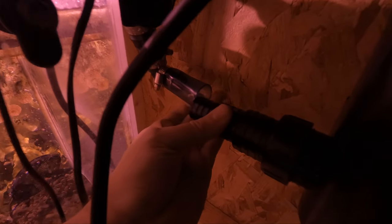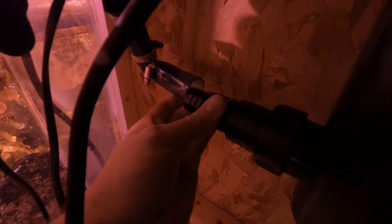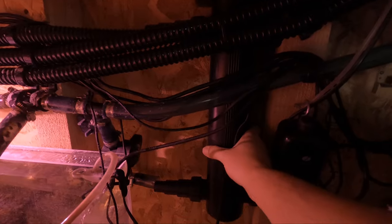So as you can see, it comes down to the tap and then it's a straight 90 degree elbow here, then that will plug in nice and smoothly there, and at the top it's all lined up. Also put a screw at the very top here and you slide that up, that'll catch it, and then I'll put a screw at the bottom and that'll hold that in place. So we'll put the top back on, slide this up, put the screw in. So that is in place and it is not going anywhere.